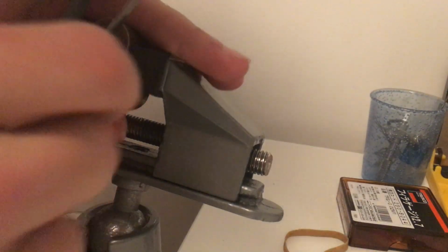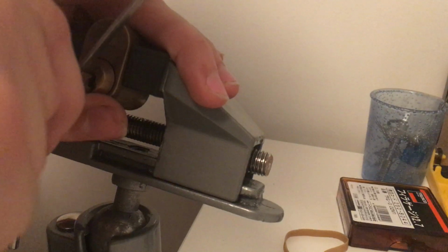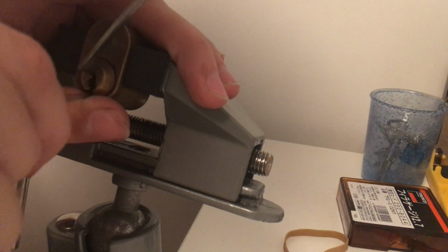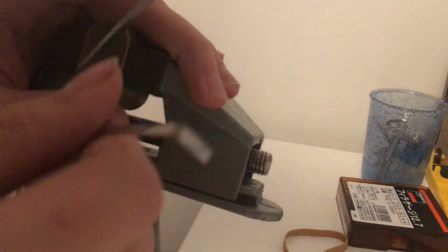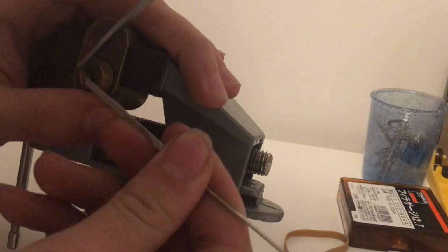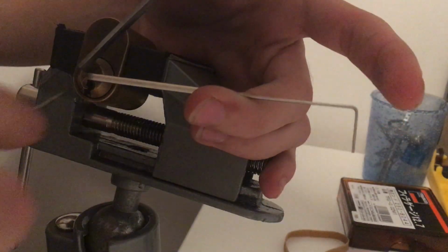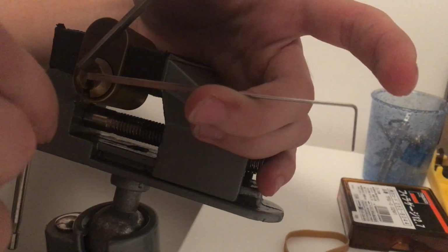First step is to pick the tapered pins. Got those set. Just using very stout tension when picking tapered. It makes their tapered part not really matter. Okay. Activating float picking. Going to pick the first pins.